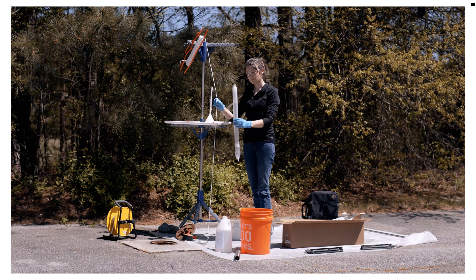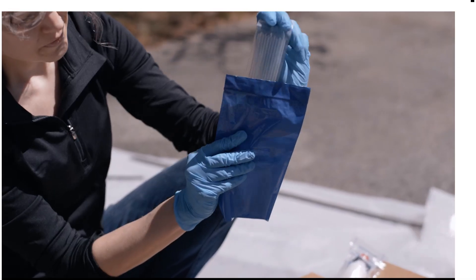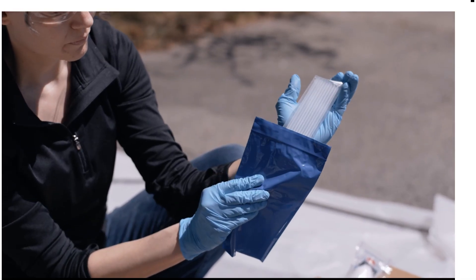In this example, the field team has already unspooled the weight and a few feet of tether and suspended it from their tripod. If a tripod is not being used, unspool several feet of tether to locate the connection rings embedded in the tether and lay the tether on clean plastic ground sheeting near the well. Next, open the boxes containing the dual membrane samplers. Locate the colored pouch containing the sample discharge straws. Save the straws to use when the samplers are recovered.